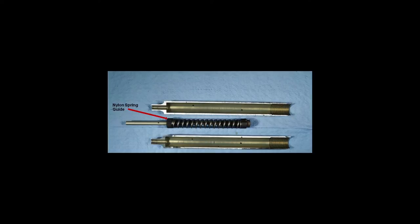This condition occurs mainly in the summer when the aircraft is parked on a hot ramp. Investigation revealed that the nylon spring guide in the bungee expands with heat, resulting in the catch. Therefore, it does not occur in flight. A design change will replace the nylon guide with an aluminum guide.